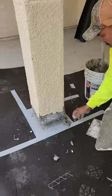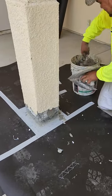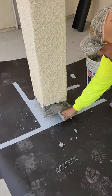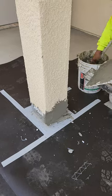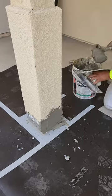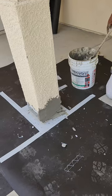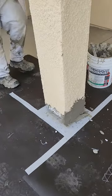This is a rapid set mortar mix. We use mortar mix simply because it's like three, four dollars less. They have the stucco mix, which is just the same mix, same material. But this has a finer sand, which we'd rather work with than the coarse sand in the stucco mix. Just how it is.